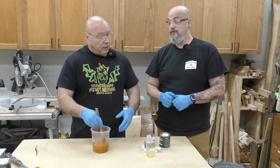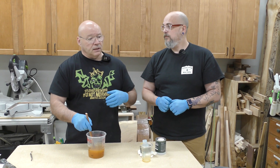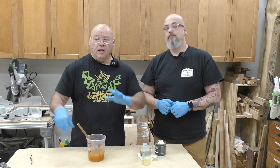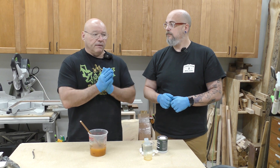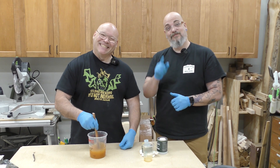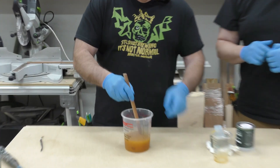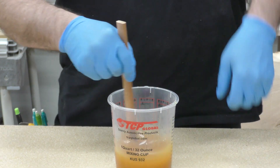As we mix everything, we use this because it's a natural oil — we will take everything and put it in a five gallon bucket of water overnight because of spontaneous combustion with natural oil. We're going to be very careful: anything we wipe off, anything that touches the oil, goes into that bucket. I had a little brush with spontaneous combustion years ago. Another great application tip: long Dominos make excellent oil stirrers!